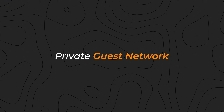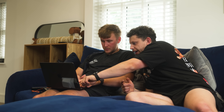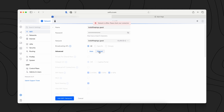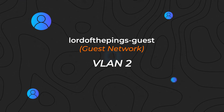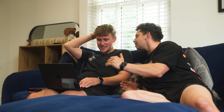Now you can have fun setting up more alarms — like when a vehicle is detected — and you can change the content of the message. For a guest network, go to networks, click new virtual network, and turn on guest network. Now we have a new network called Lord of the Things Guests with VLAN ID 2. Create a Wi-Fi SSID for it and turn off 2.4, leaving it on 5 and 6. Anybody on that guest network can't see things on your private network like your TVs, so guests can't cast to your TV. It keeps everything separate and still gives them internet access.